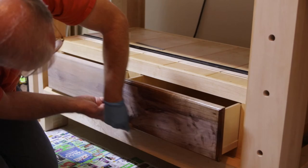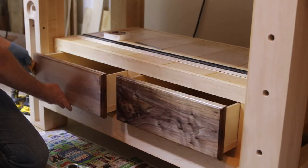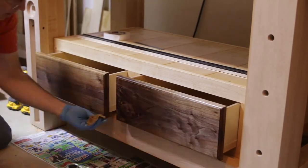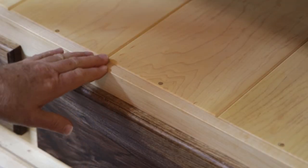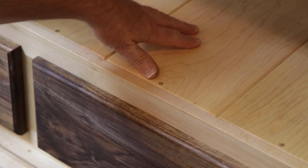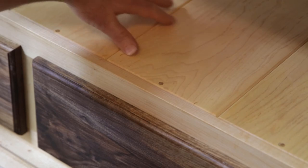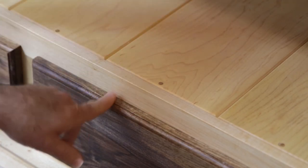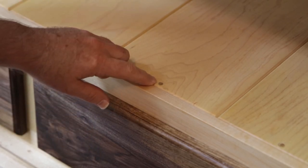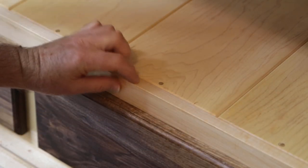Some boiled linseed oil really brought out the grain — this one piece on the right side is just spectacular. For the top of the drawer cabinet I used tongue and groove boards, about an inch and a quarter thick maple, so they're pretty thick and strong. This is basically the same design as the shelf in Chris Schwartz's book; I just put it on top of my drawer cabinet instead of down on top of the stretchers. I used quarter-inch dowels to pin it into the rabbet that's in the top of the inch-and-a-quarter side piece.